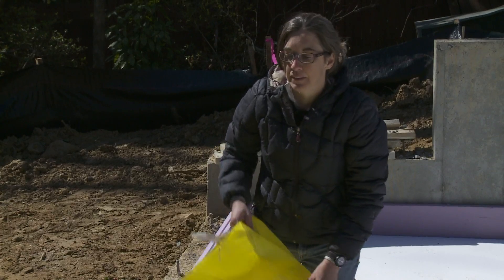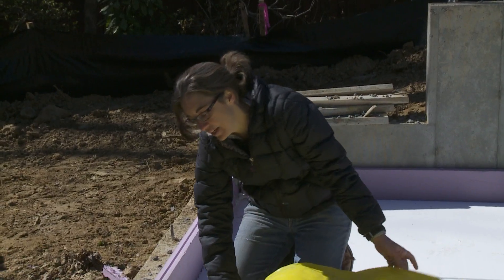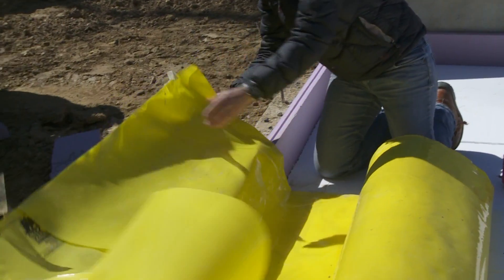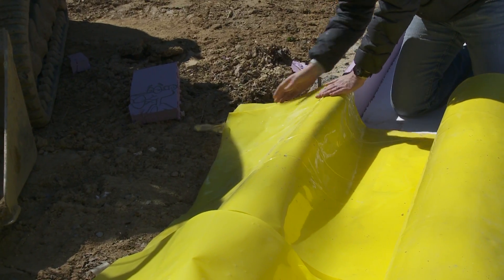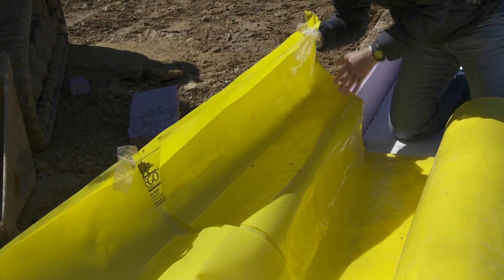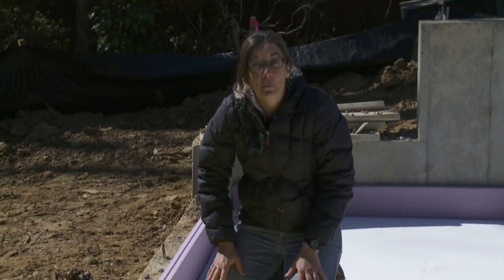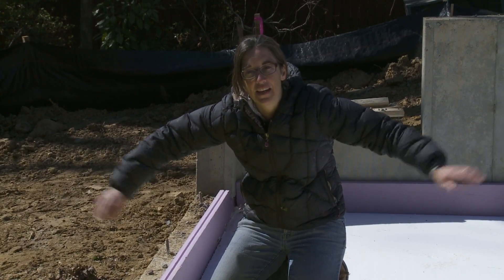What's important to know is that in this case, a lot of times what happens with a normal house is your vapor barrier just comes to here and stops. In this case, our vapor barrier is going to lap over the side of the house. And then when we put our frame wall, we will wrap the vapor barrier up the side of the house and tape it. So it's almost like a little bathtub — what it does is it keeps all of the bad air, radon, all the things that we don't want in our house, outside the envelope of your home.